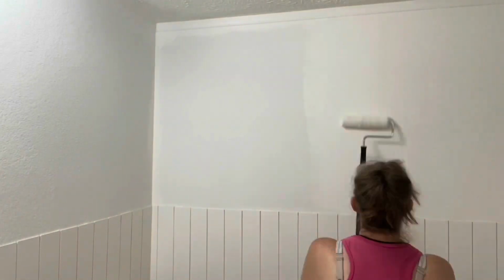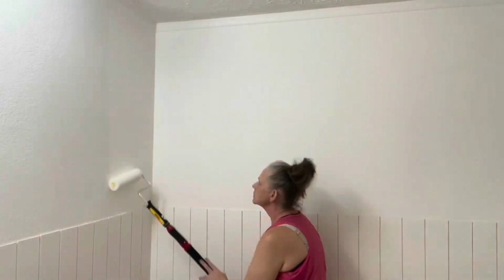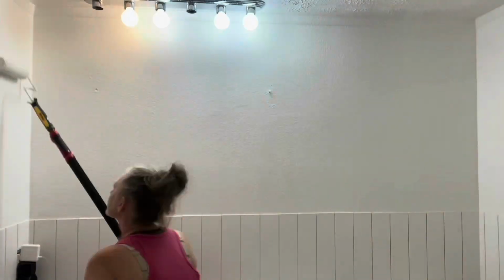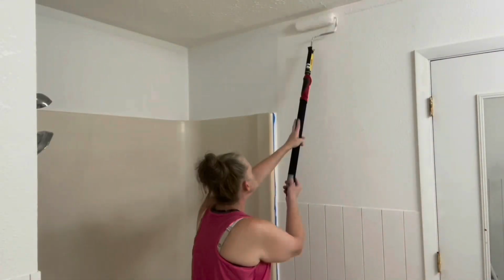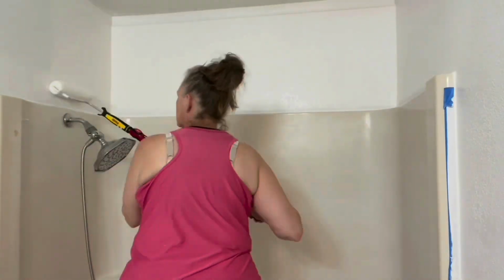This is the Sherwin-Williams in satin showcase paint sold at Lowe's. It is definitely not a 1 coat paint. It does go on very nicely, but it did take 2 full coats on both the Knockdown and on the Faux Shiplap even after 2 full coats of primer were already on it.